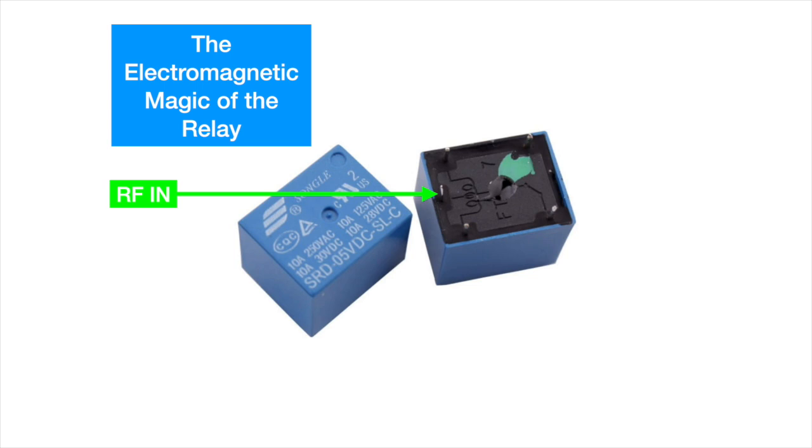As it is at the moment, if we put some RF to this pin, there are two places that RF can go: the normally closed and the normally open pins. Normally closed is what it says — the RF will come in on the green and go all the way through to the pink, because it just looks like a piece of wire with electrical connectivity all the way through. The normally open pin will look like an open circuit because it is — normally open. So nothing there, and all the signal will flow in through the green through the relay and appear on that pin.